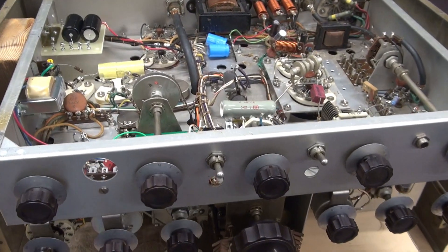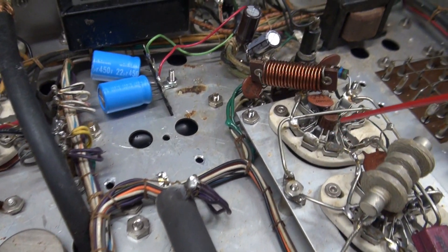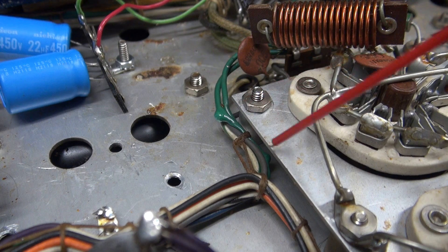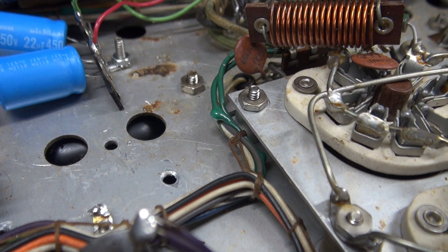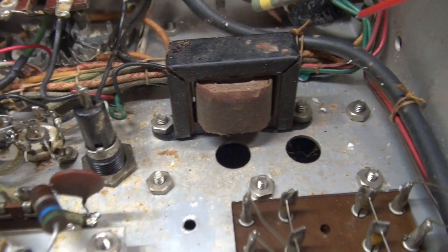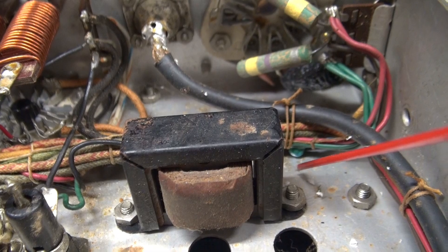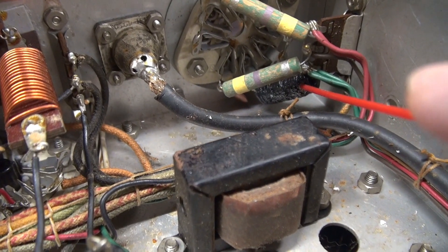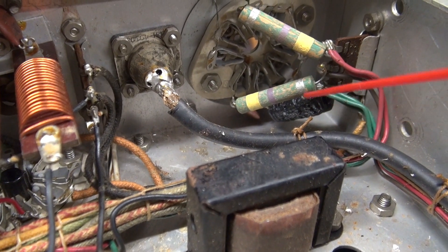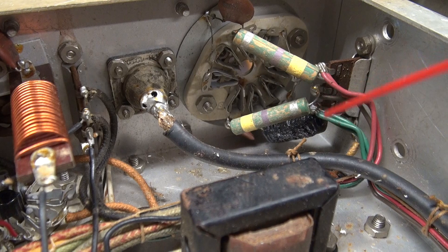I had to put the Viking up on its top to install the new push-to-talk module. While wiring the module up, something caught my eye — looking over by the 6146, I spotted some green filament wires, and one of them has a blister on the side indicating it got hot. I inspected the rest of the wire harness and didn't see any signs of overheating until I got over to the rear VFO socket, where there's another blob. I followed the wires up and found a black gooey cylinder — that's supposed to be a coil of wire. What happened in the past: somebody hooked up an incorrect VFO, or their VFO developed a short on the filament circuit.